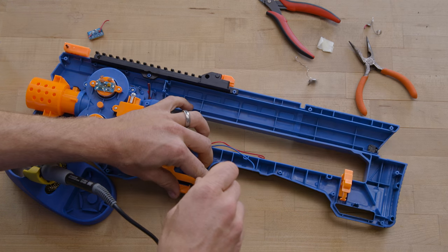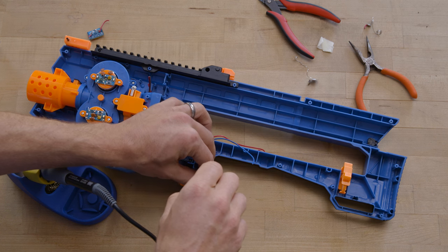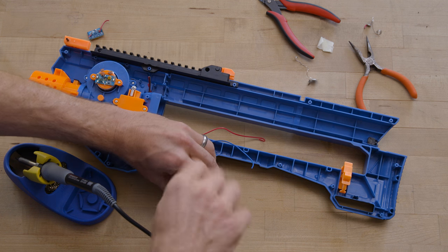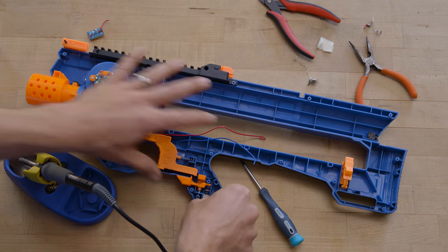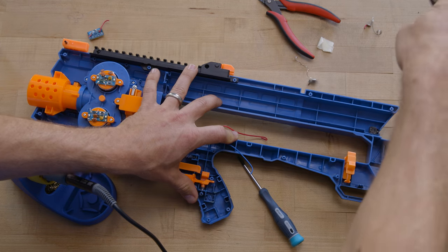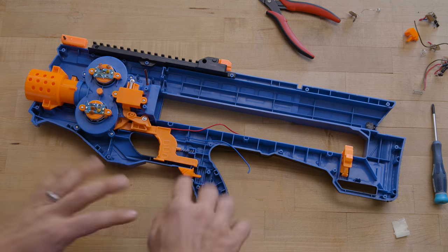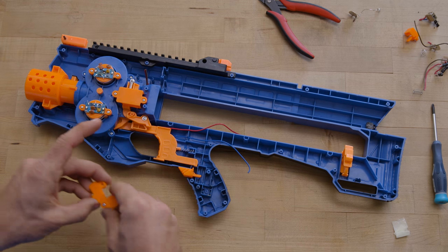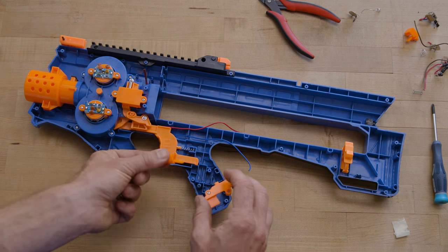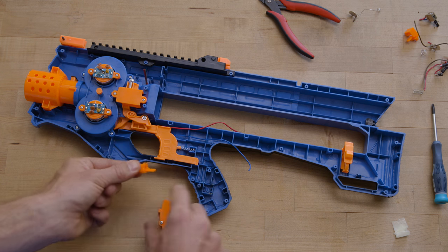Again, number one Phillips, to start pulling pieces out. We are going to take out the existing microswitch and assembly because it's, of course, much too low amperage for our purposes. So this is also garbage. Again, pliers are usually very helpful. This can go, this can go. So the only part from this assembly down here that we are actually going to need is this little plate, the two screws that go in it, and this one piece. Our spring action will actually come from our microswitch in the end of this.